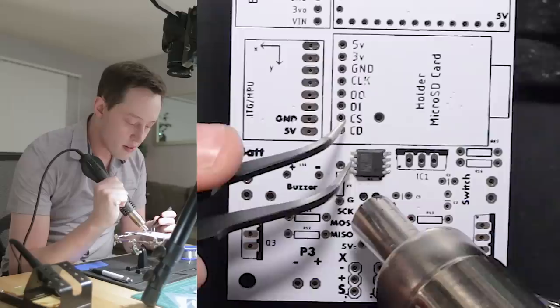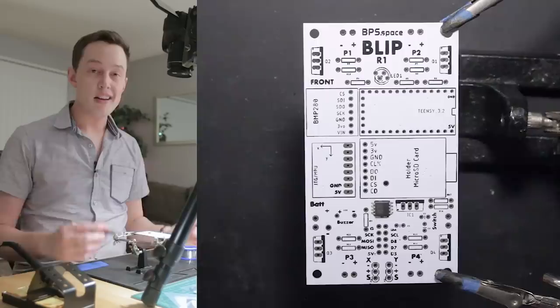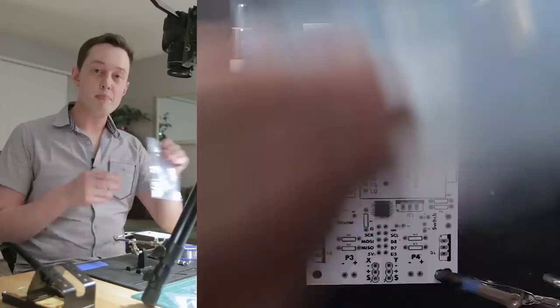This little dot on the board indicates which direction the dot on the actual flash chip should be oriented. So we turn the chip so this dot and the board dot line up with the same corner, then we can place it on the board. To do this, I'm going to use the heat gun — this is the only thing I'll be using the heat gun for during this project. I'll heat up the board just a little bit, then drop the flash chip on there and let things melt together. Feels like we have a good connection on all those different pins, so I'll remove the heat and let it cool. Just like that — this is the hardest part of the board to assemble. Everything is easier from here.